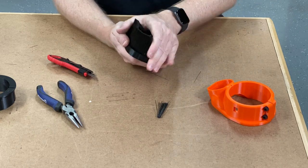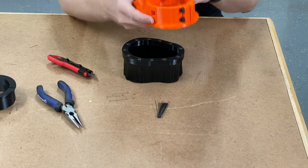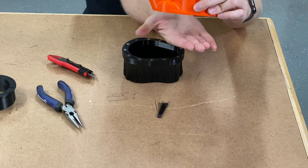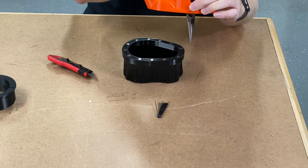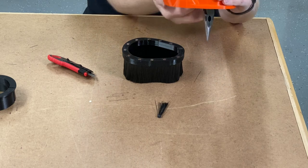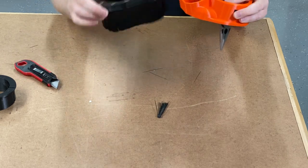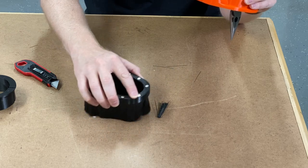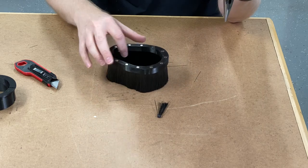These bristles are kind of long on purpose because this sits way up on the body. The main body part of your machine should basically stop right at the bottom of this track. From there you've got your chuck sticking out, usually about a half inch or an inch, and then your bit, which is another inch or so. It's okay for these longer brushes to bend a little, especially as you're cutting, but you do want it sitting on the surface for the most part when you're cutting.